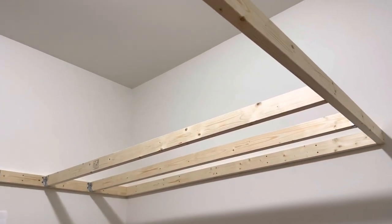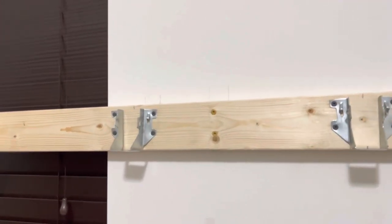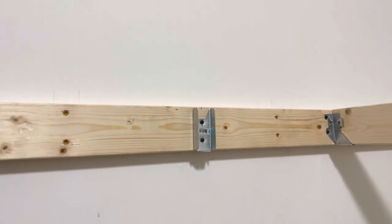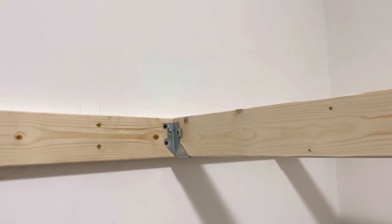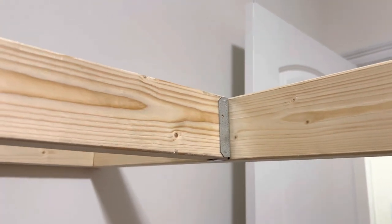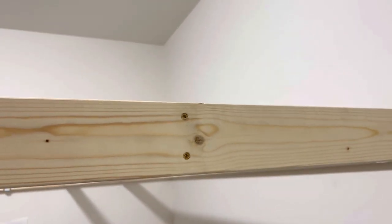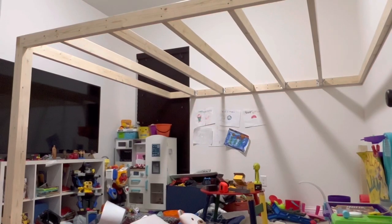Next I put up five more 8-foot 2x4 pieces as the main support for the second floor. I tried two products: the 2x4 joist hanger and a 2x4 fence support bracket — the bracket looks cleaner. Ultimately I just used 5-inch screws and screwed them directly together, which was super strong and safe. I placed them 19.2 inches apart to keep them evenly distributed. I tested it myself — I weigh over 162 pounds — and it didn't budge at all.